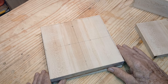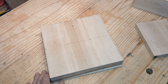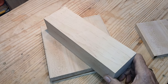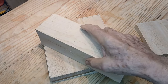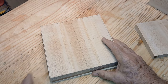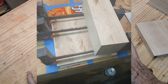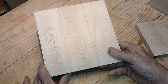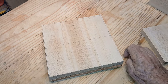The way I made it is I bought a chunk of hard maple off of eBay — this is what's left of it. I'll try to throw a picture up on the screen. It's 10 inches long, 3 inches deep, and 7 inches wide. I cut enough of it off, ripped it to 7/8 — slightly larger so I could plane it and sand it to make a 7/8 inch blank. I took three pieces of that block and glued them together to make that blank right there. I also got a little bit more for the base of the bowl.